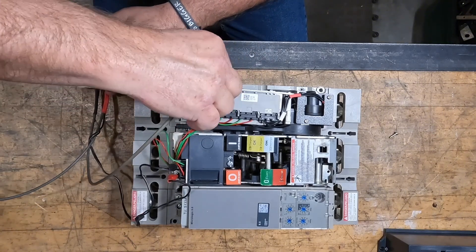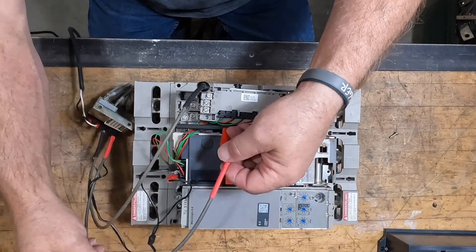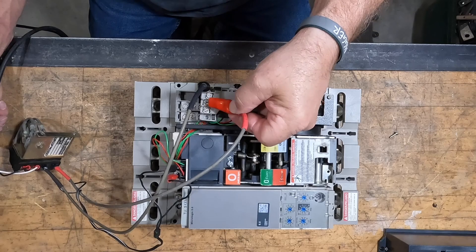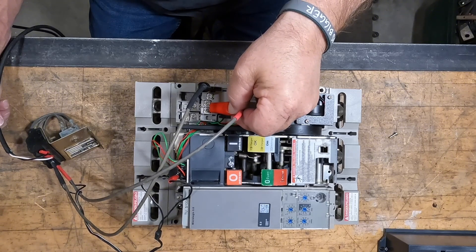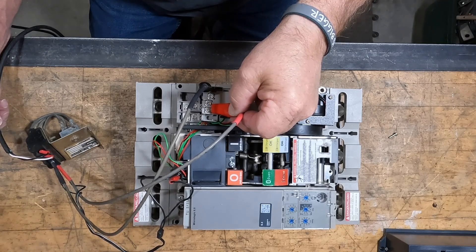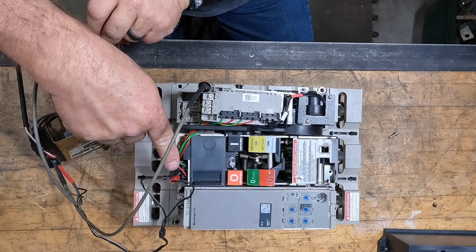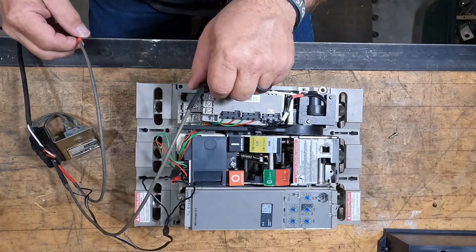I'm also adding the same 24 volts to my common on the end of the power rail and then we're going to run a charge circuit. You'll see the flags move on the motor as we charge the breaker, run the motor, then close it and trip it — going to do this a few times to make sure everything sounds right and runs right. Run charge, make sure the mechanism charges all the way, the cutoff switch works, close it and trip it. Taking the power off the UV frees up the breaker and trips it open.